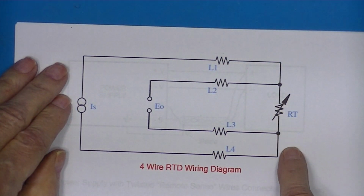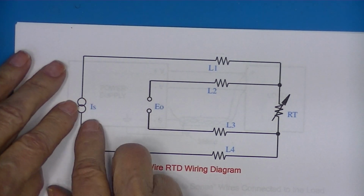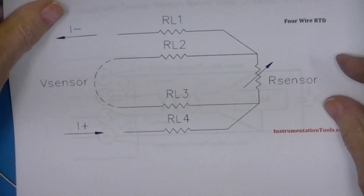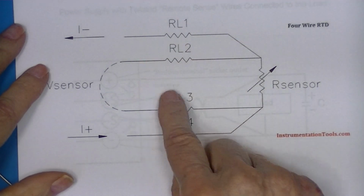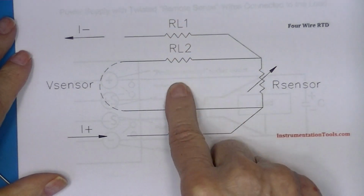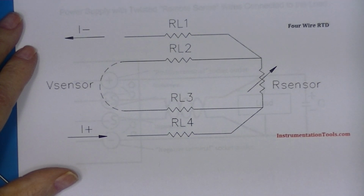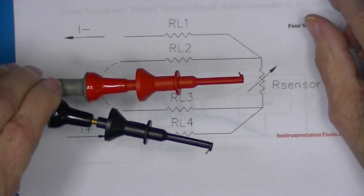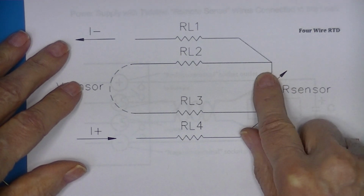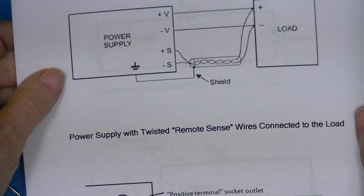There's a current source and a current loop and a voltmeter over here. And these are usually located not together, but in a control room. This could be located out in the factory somewhere. Also looks like this, which is the same thing. Current loop, an RTD, which is a resistance temperature device, and the voltage sensor. These are wire resistance. And the idea of this is to ignore them. So it's not just always measuring with a set of leads and an ohmmeter. Could be an industrial situation where this is extremely remote or inaccessible. And the last I'm going to discuss, but not, there are more.